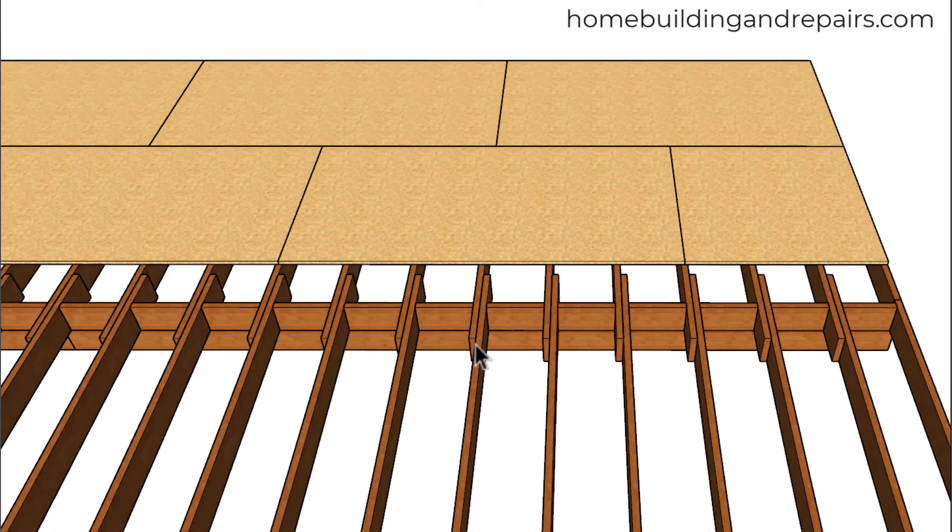And if you want to use a smaller board, which is what I would want to do, you're going to want to add the extender board over here and then have the next gap between the pieces of floor sheathing centering on this joist here and not this one.